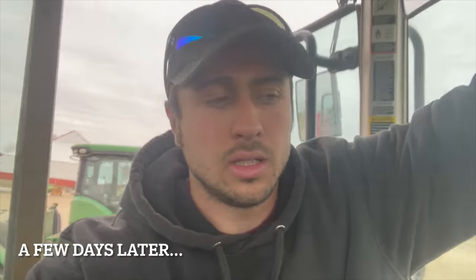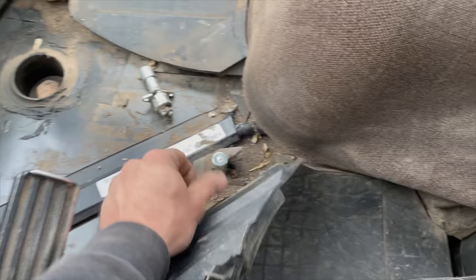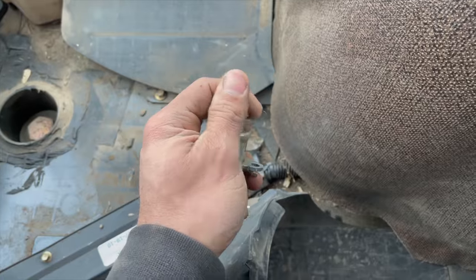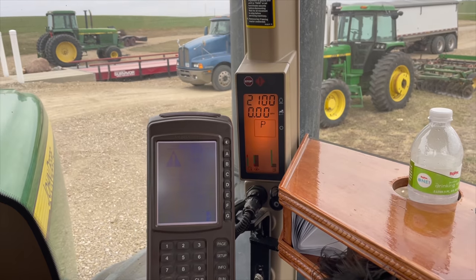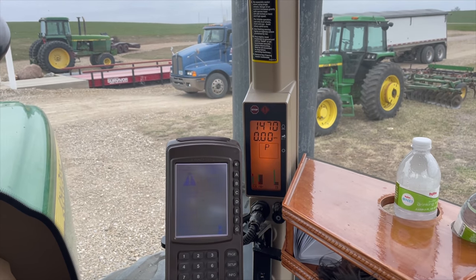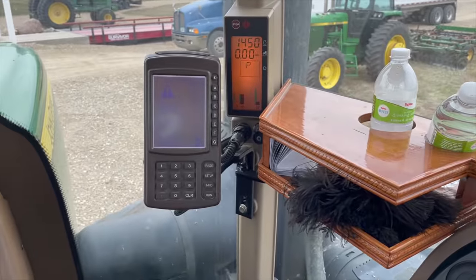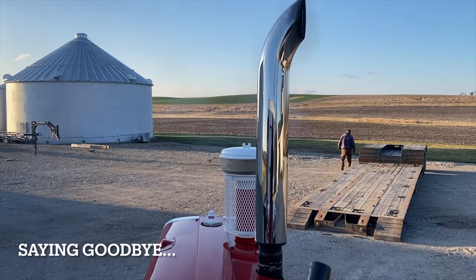Little project on the 9430. Looks like a Tuesday, looks like it's gonna rain tomorrow. The cab here on the 9430 has this decelerator switch. Coming to a waterway or end rows, you can be going through in the same gear, push that decelerator switch, and it'll idle you down. I think it's a percentage of what your throttle is — so that's pretty nice. Come to the waterway, end rows, whatever — push that and it'll idle you down, you don't have to shift gears. We got just two wires going to that. We're gonna test her out. Here's the tractor running at 2100 RPM right now. Hit the decelerator switch — it goes to 1470. You can adjust that. I got it at 65%. We'll see how that does for the speed when you're going through the field.